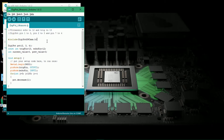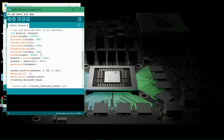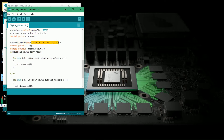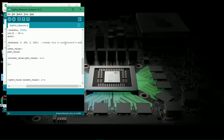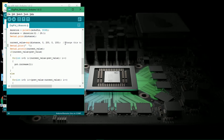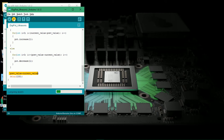This program uses a library for the digipot built specially for ICs of this series. What the program does is: first, it brings the wiper value to 0 ohms by decreasing the resistance 100 times, which is the maximum. After that, it calculates the distance in centimeters and maps the value between 0 and 200 from the ultrasonic sensor to 0 to 100 for the digipot, as there are 100 number of steps. You should change the value of 200 to the maximum possible distance in your project for better response, and that distance can be found using the serial monitor from this sketch itself. After mapping, the resistance of the digipot is increased or decreased in accordance with the distance calculated by the program.